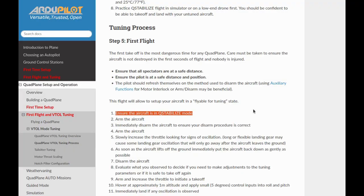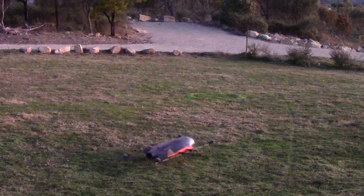I was very happy to see that it did fly on that first flight. There were a couple of mistakes I made. I didn't follow the ArduPilot wiki guidelines to do the flight in stabilised mode. Instead I was in position hold mode, which meant that the severe oscillations in roll and pitch meant I didn't really have altitude control, so it went up but was reluctant to come back down. So make sure you do your initial flights in stabilised. The other problem was that the default PID loop gains on quad plane are quite high because typically quad planes have a high moment of inertia. But because I didn't have the wings attached, the gains were way too high, and that was the cause of the oscillation.